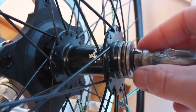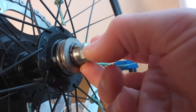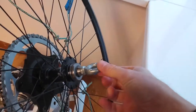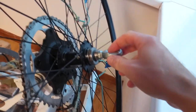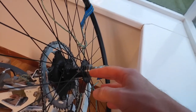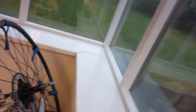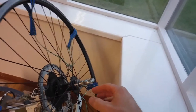This thrust bearing here is a little bit loose, and it's just with a circlip on there, cut into the shaft. There's an eye bolt on the end — I've tapped into that shaft and put an eye bolt on. Hoping in future revisions, we've had before a hollow shaft when we had the bicycle, we might be able to winch the main line of the main lifting kite up and down through a hollow axis — we'll see about that.